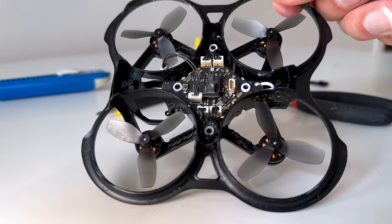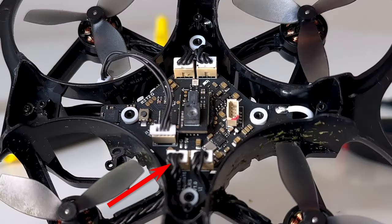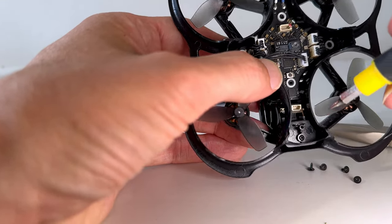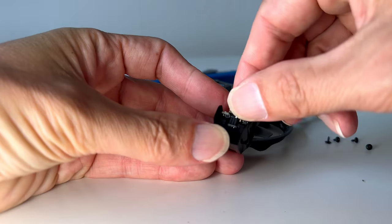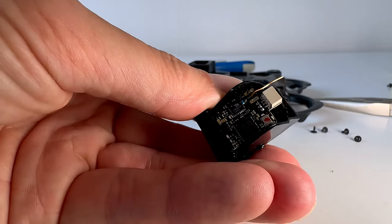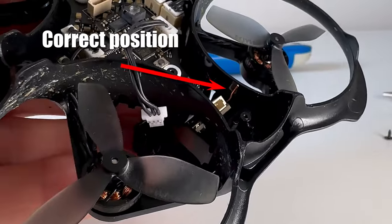After lots of research and reaching out to Beta FPV, I finally bring out my screwdriver to perform some surgery. Apparently the connectors can get loose after some crashes, along with various other problems. My problem turned out to be this little wire — it's an antenna that transmits the image from the drone to the goggles. It was slightly bent, and when I straightened it, the image was perfectly fine and I could finally use the 350mW setting.